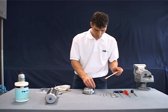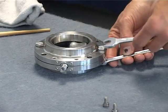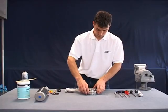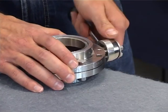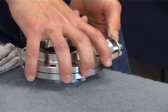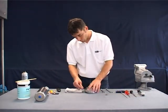Lubricate the threads of the flange bolts. Tighten the nuts until there is a gap approximately one or two millimeters or one sixteenth of an inch wide between the casing flanges. Use a manual handle or wrench to open and close the valve three or four times for aligning the flap seal. Finally locate the flap disc into the closed position, mount the blind plug and finish tightening the flange bolts.